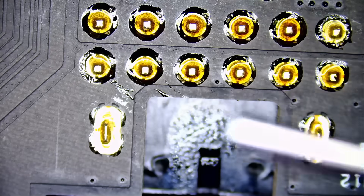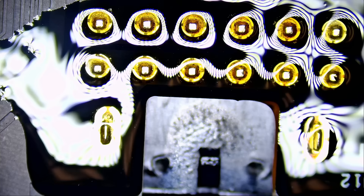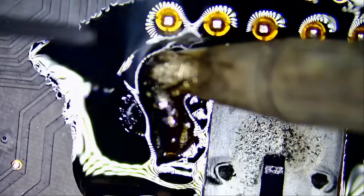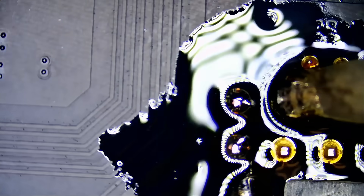Okay, enough preheating. Now we're going to apply NF dot flux and it's going to melt right away because the board is hot. We're going to grab low melt solder — fume extractor on. Let me apply low melt solder before the board cools down. We apply more flux because preheating the board affects the flow of solder, so we apply more flux so the solder can spread evenly. You can see how it covers the whole pad — if it's not covering the whole pad we either need more flux or more low melt. A little bit of low melt solder goes a long way.